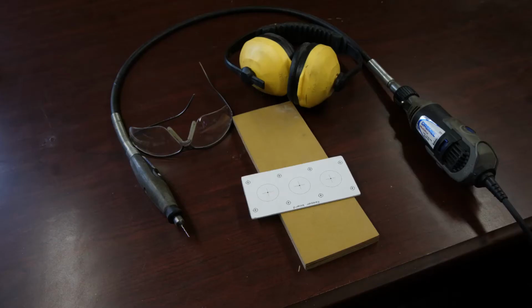And now for drilling. Drill pilot holes first for every hole. A 1/16-inch bit is perfect. Resist the temptation to drill out any of the holes to their finished sizes, even if you have the bolts ready at hand. The best Dremel accessory I've ever used is this flexible shaft.